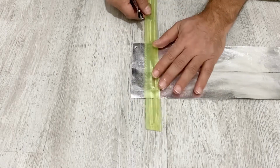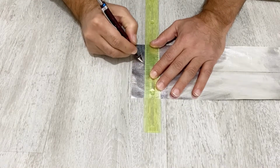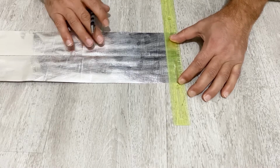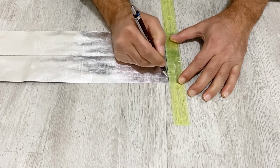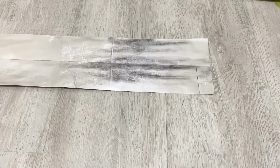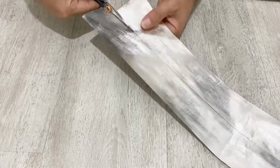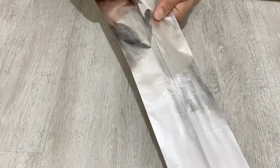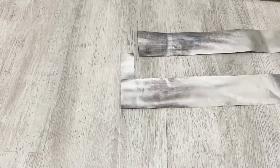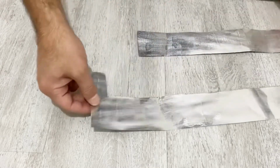At this point it is very important. I will leave some part of the aluminum foil to make the terminal of my supercapacitor. Part here and some part here. Now when I cut the aluminum foil into two pieces, I won't cut these small parts, my friends. Just watch carefully. You see, my friends, these parts will be the terminals for our supercapacitor, so it's a very important point.